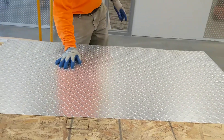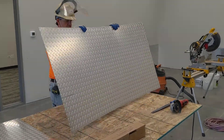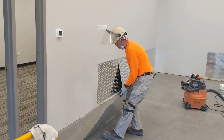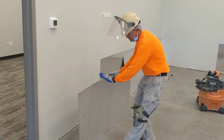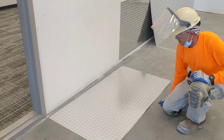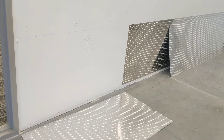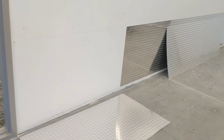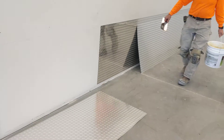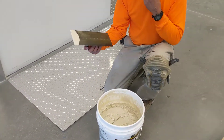There's no other cutouts in this one for electrical or anything, so we're just going to move it up and stick it on the wall. I'm going to pick it up — the bottom's already where it needs to be — and just pump it up and stick it to the wall. We're using a Mastic adhesive, the same one that you use for tile.